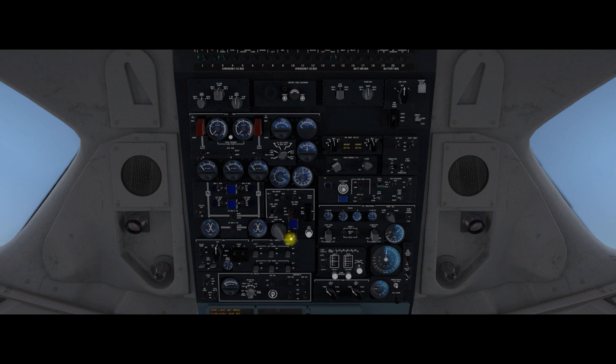Okay, I've pulled that down now and you should hear the APU winding up and you'll see the EGT coming up and the pressure coming up. When it gets to around about 90% to 100%, the APU light will come on — which is bright pale blue — and then we need to turn on the left and right APU buses. So we're just waiting for that pressure to come up to around about 90% to 100% and when it does we can move into the next part of the process. It does take a little while and you can probably hear it winding up in the background.